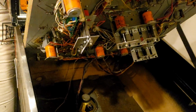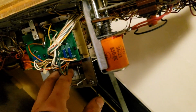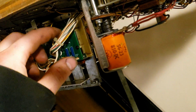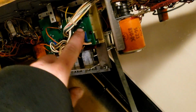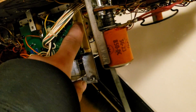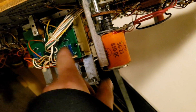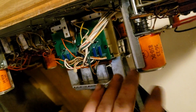And then I had to install, I got sick and tired of those stupid horseshoes, so I installed some NMP sensors. It's pretty simple. I believe it stands for North Magnetic Pole, but let me know in the comments down below if you know. You just basically glue the magnet into the drop target, and this little sensor down here will sense the magnet, and that'll take care of your scoring. And I had to solder all those in.